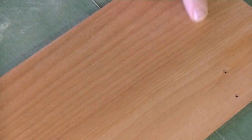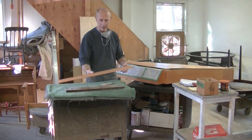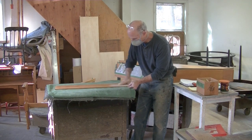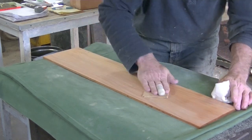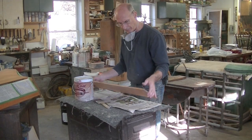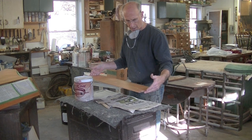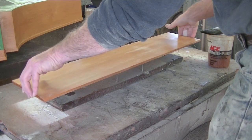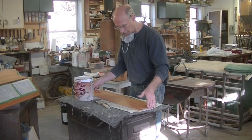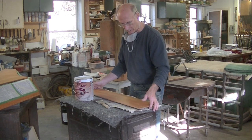Okay, so all the shellac has dried overnight. It all looks pretty good, and so now I'm going to sand with 320-grit gold. I'm going to sand everything and then apply a second coat of shellac. Now, remember that this fallboard is double-sided. I'm doing both sides, and for the first coat I did one side and flipped it over on a nail board, but that's only good for the first coat. This second coat, which will also be my final coat, I'm going to do each side separately.